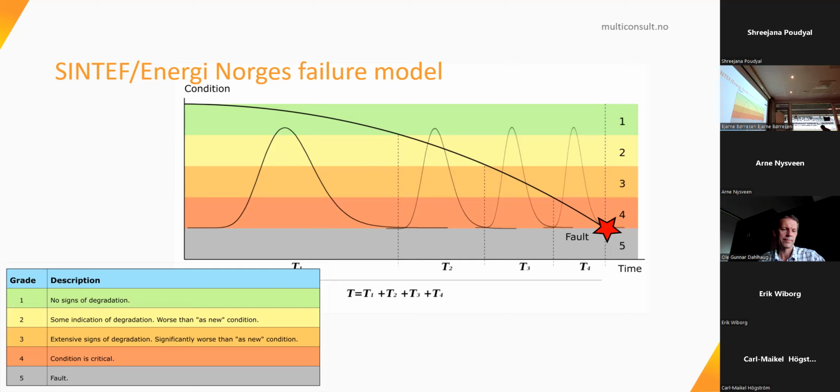But then that is within what was called a handbook for power production. For different components, there's a more detailed description on what these different states or conditions actually mean in terms of corrosion, in terms of cavitation, in terms of runner cracking, fatigues. And exactly the same is used, unfortunately, for the civil part, dams, somehow the scale starts with 0, but again goes to 3. But again, for concrete dams, for rockfill dams, etc., you have the same in the handbook.